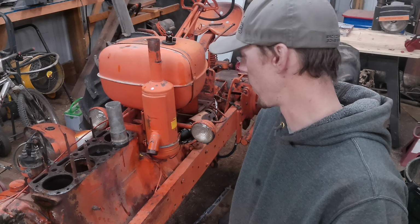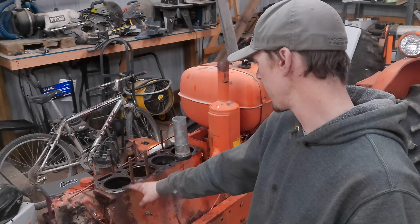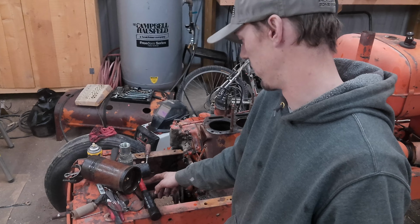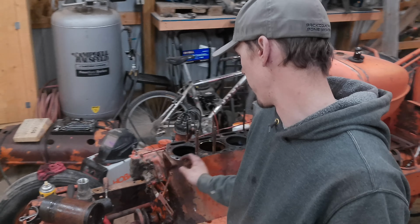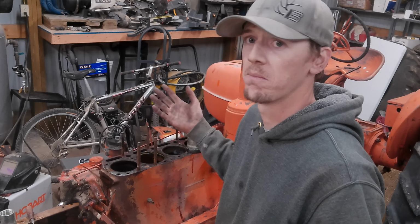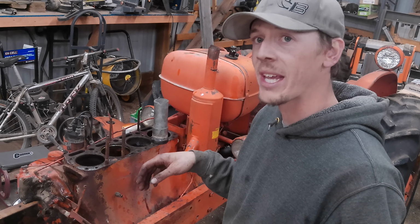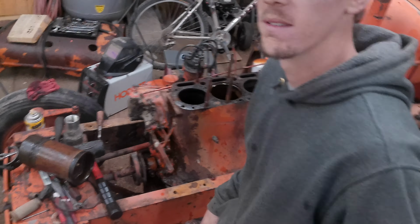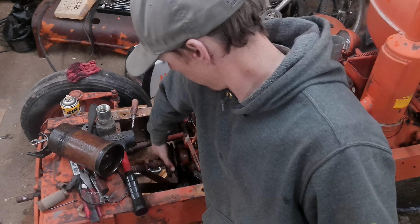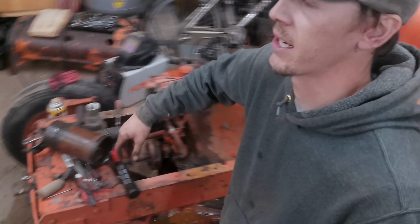That's exactly what we wanted to see on this thing. We got the two easy pistons out. We're able to see, even though this thing was getting stuck, we couldn't hone it out with my really cheap tool. So it was still hanging out here. So we popped out the sleeve, which, whatever, because we'll just stick new sleeves in there anyways. So we've proven that we can do that. We've proven that the crank spins freely. It spins freely.